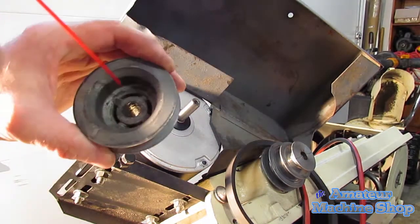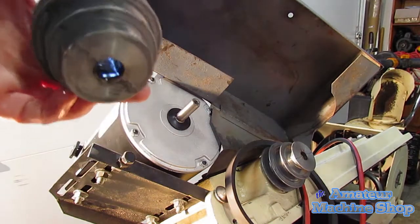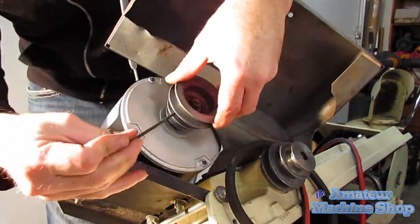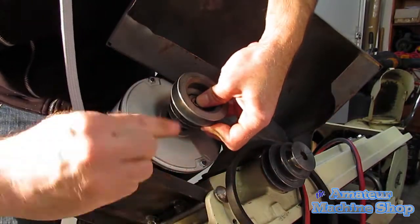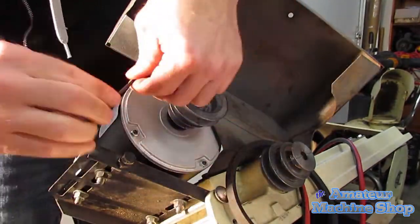The motor was placed on the bracket. You will notice the long slots for the motor to be mounted. This allows for a variety of motors to be used and a lot of positioning options. The pulley was placed on the shaft and then came lining up the motor pulley with the gearbox pulley.